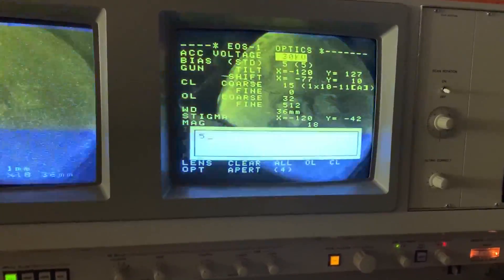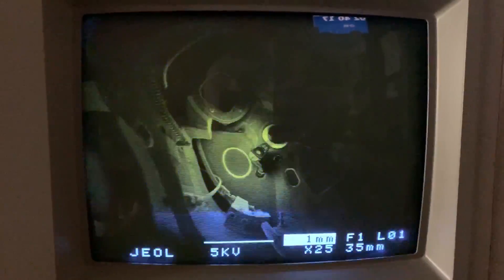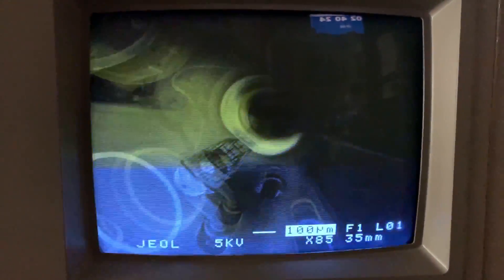I have the beam cranked up to 30,000 volts — as high as the machine will go — and the insulator is charging up. As I zoom in, you can see little fragments of plastic on the surface of the pellet starting to move around, attracting and repelling each other as the charge is evenly distributed around the sphere. I drop the beam's potential down to 5 kV, and after a little knob turning, we get the expected electron mirror effect. We're able to image the inside of the electron microscope and get these distorted but useful pictures that could be used to inspect the instrument or just to mess around.